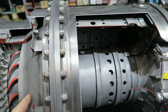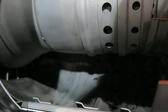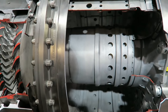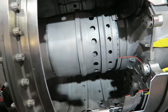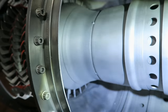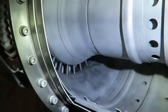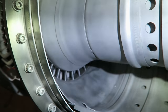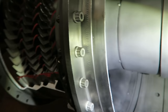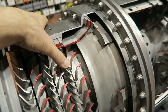The first stage nozzles are right here. You could call this area the transition duct — the bottom of the combustor. I'm going to look inside there with my trusty flashlight. You can see the transition — it's decreasing in total area, so it's increasing the velocity of the gases, which get passed through the first stage nozzle into the turbine.